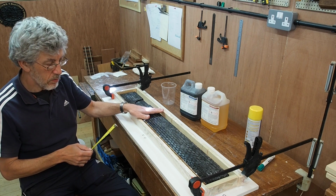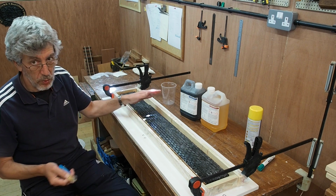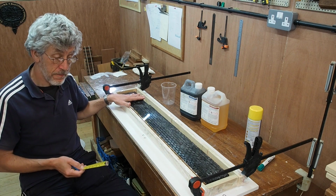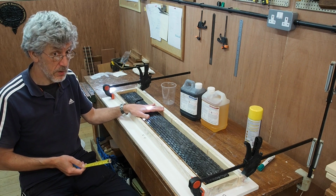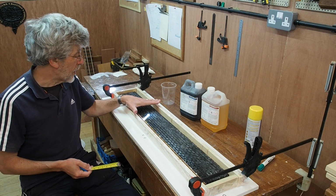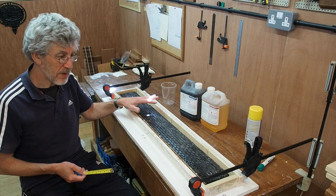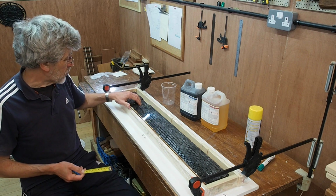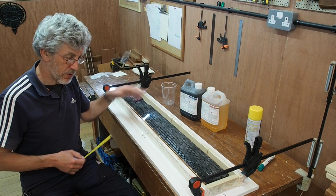We don't want more than half a centimetre above that. So if I say that the outside is 3.84 centimetres. Interestingly, because you've got quite a large area here, the difference between settling on 3.8 or 4 centimetres high is 200 cc's of that material. That's like 6 quid's worth of material, so not to be sniffed at. We'll go for 3.8 because that gives a little bit of leeway. 3.7 would be fine. Also allowing for the dip here, it'll take a little bit more rubber than if it was just perfectly flat.